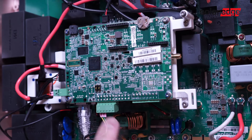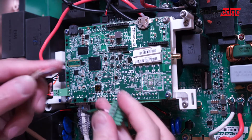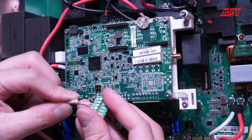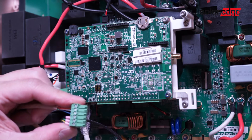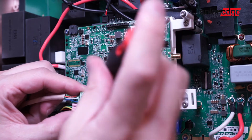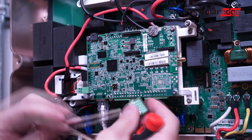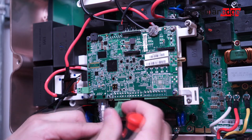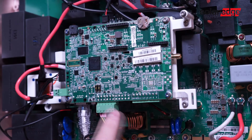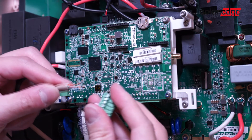When wiring RS-485, be sure to use a twisted pair for B and A, and the conductor of your choice for G. Remove the RS-485 termination block, land wires, and tighten the screw terminations. Replace the RS-485 termination block. Repeat the process using the same color coding for each inverter in the RS-485 daisy chain.